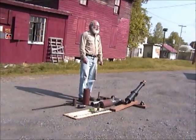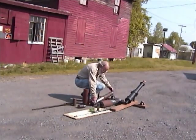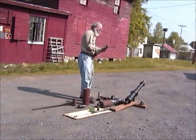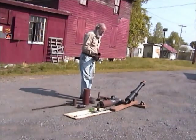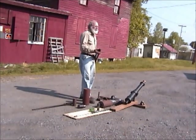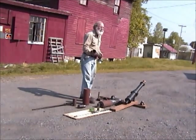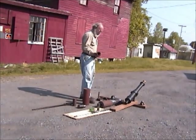What we're going to show you today is how a swivel gun, a small cannon, is assembled. The first part we have is we've cut a 28-inch long piece of 3¼-inch seamless tubing that has a 2-inch bore in it. And because as manufactured it has a slightly irregular outside and a slightly irregular inside, I've turned it so that the part that's going to be inside the larger tube is a true 3.251 diameter and relatively smooth.